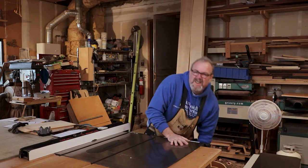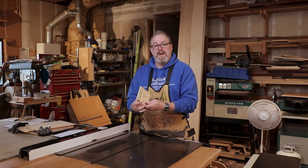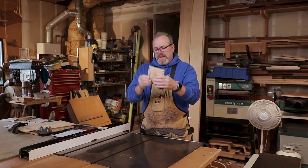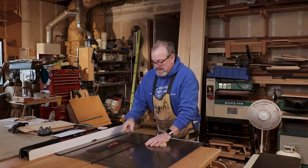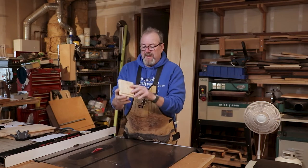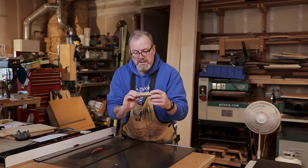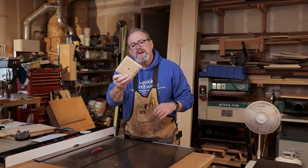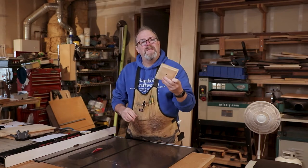Another thing — right here — this is my blade height adjuster jig, and I'm going to show you this closer up. This is for setting your table saw blade height. If you ever want to set your blade height to different sizes, it goes from an eighth inch to a quarter inch to five-sixteenths and three-eighths — those are the sizes I use the most. You can make them whatever you like, and I'll show you how to make this real quick in a video right after this one.